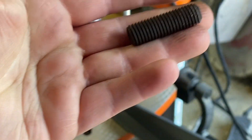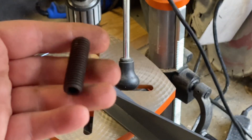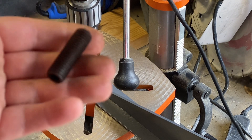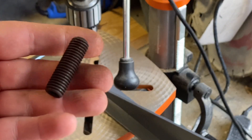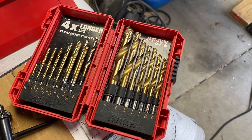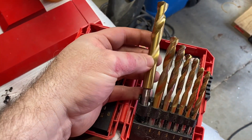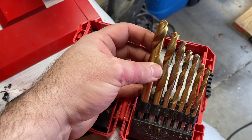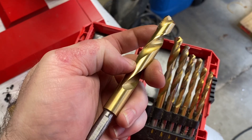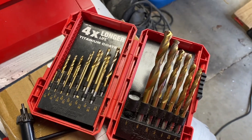The studs for this thing are probably classed as M12 — with my calipers they measure at 11.5 millimeters. My half-inch drill bit, the largest one in my set, is slightly oversized but big enough, and the next drill bit down is too small. So we'll be using the half-inch drill bit to drill this out.